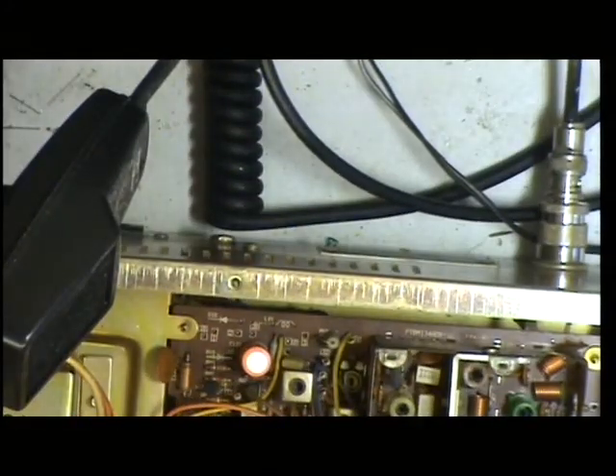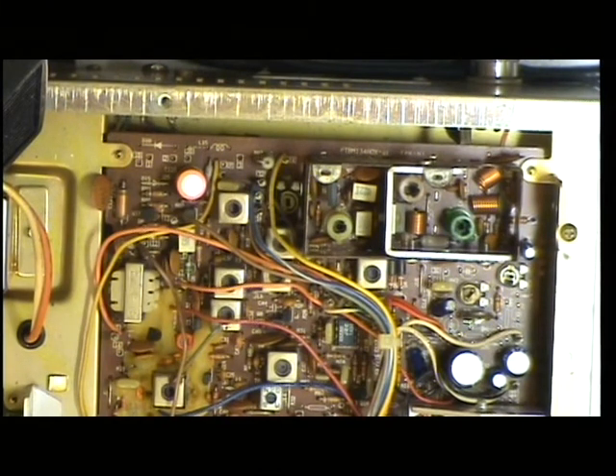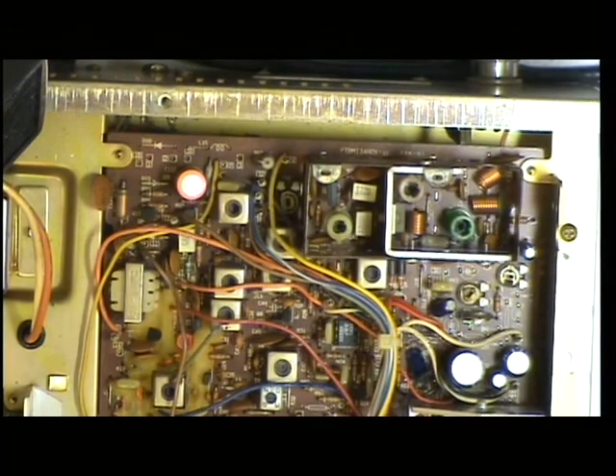Now on low, we want to do the low power setting. I often find that the low power control on the 7134 is a bit iffy - we usually end up having to clean it with service spray or similar switch cleaner type lubricants. And that's RV4, so I'm just going to flick to low power. We're actually getting 0.4 of a watt. I'm not going to adjust it because it's spot on. It's the preset down there - often it's dirty and you end up with nothing on low power, but it should be 0.4 and it is on this particular radio.